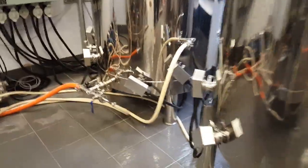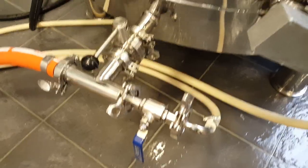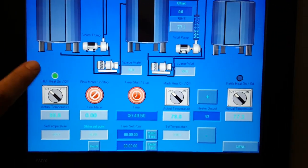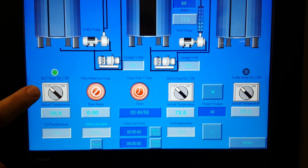It's all going to start with the hot liquor tank. I'm going to get good shots of all these fittings so that everybody can see what I'm doing, and we'll talk about them all in a few minutes. I've got some water in here — you can see the level in the sight glass. That little buzzing is just an electronic interlock that prevents me from opening this door if there's power, because there's a 200-amp service, 3-phase coming in, and that'll do some damage if I stick my hands in there. So this is the main screen. You can see this little green light — it tells me that there's enough water in the hot liquor tank to turn the heaters on.